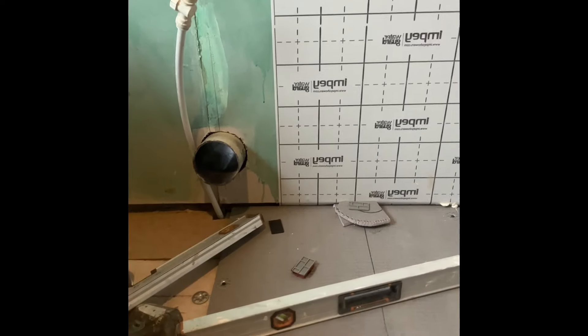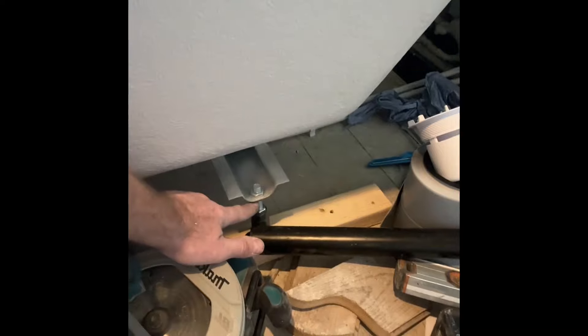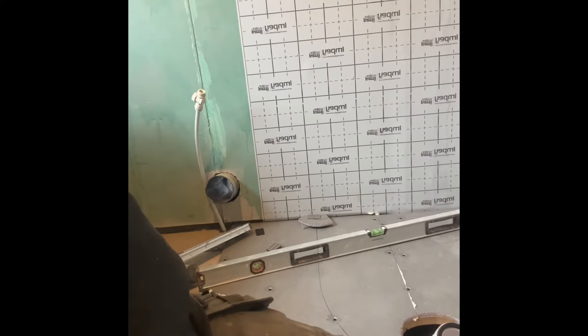See how it lifts up in that corner — that's how much we need. Drop the tray and you can see it on that leg there — see how long that leg is, and see how short that leg is — that's how much it trips out. Once I batten this floor off, we'll fill that and throw in a couple of bags of self-level to help it out a bit. Otherwise even the toilet is going to feel off-balance walking in — that's how far out it is. That's like 25 mil difference, and 25 mil is noticeable.